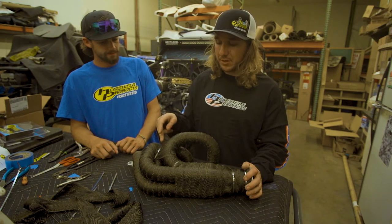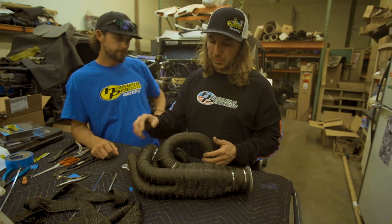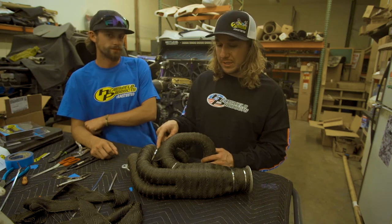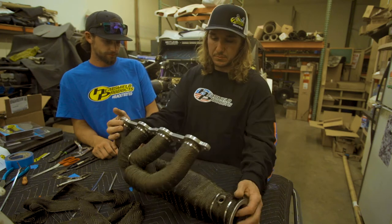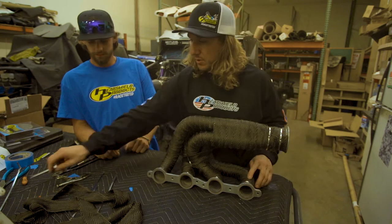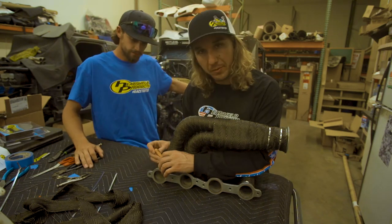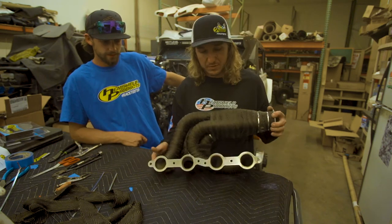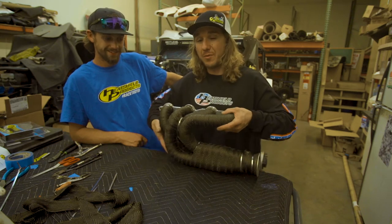Also where it wasn't touching and there's gaps, we came through and around it multiple times in multiple tubes, and we left enough slack to put a tensioner in the middle of all that. So that's definitely something that can help. The ends, after you cut the ends of the bands, we like to use a little pick. After we put it under there, lift it up a little, bend it down to keep those little tangs down so you don't slice your fingers, because those little stainless steel things are sharp and they'll get you.